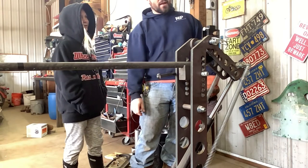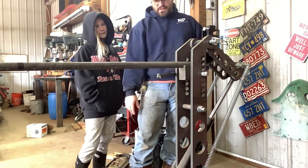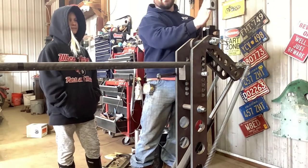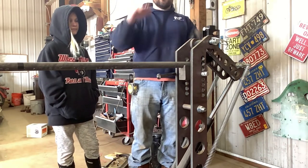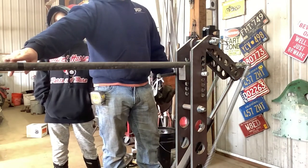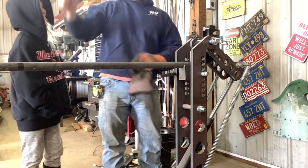I'm at 89.3 degrees, so I could go probably another 16th inch of stroke — I'll go to 12 and 9/16th. Remember this is the back side of the cage, so if anything my roof will just rake down a little bit. Everything is going to depend on this last angle when my measurements at the top are where they need to be for the cage.